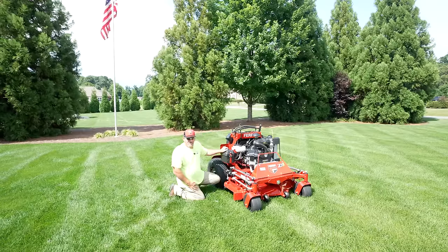The feel of the hydraulics, I find there to be a slight, very slight delay in when I push them forward and when the machine reacts. Now that could very well be in the linkage. You could adjust the linkage to where it's absolutely dead on. But once I get past the first quarter to a half an inch, roughly quarter inch, then they become extremely responsive. I mean, very touchy feely, and I like that a lot. I really, really like the hydraulic setup on this machine.